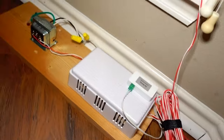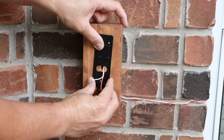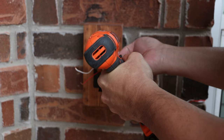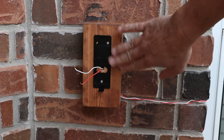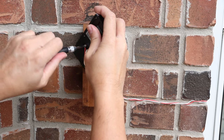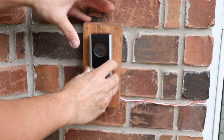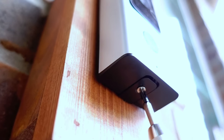Time to install the video doorbell outside. First, make sure the breakers are off — or in my case, the doorbell chime and transformer are unplugged. Push the doorbell wires through the hole in the mounting bracket and screw in the bracket using the included screws. Loosen the terminal screws and connect the doorbell wires — it doesn't matter which wire connects to which terminal. Push the doorbell onto the mounting bracket and secure it by screwing it on the bottom.